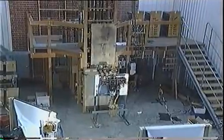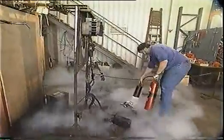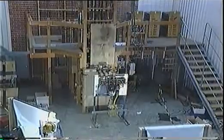The third 400-amp circuit breaker created a massive arcing fault, and clearly anyone in front of this MCCB would have been severely injured or killed. The breaker blew off the panel and started fires in the test cell. The view from the second recording camera shows the extent of the blast. In slow motion, molten metal can be seen escaping in all directions.